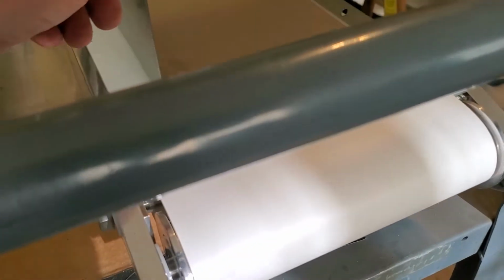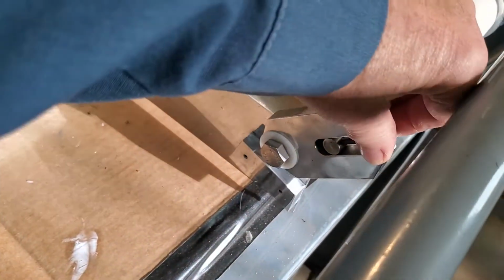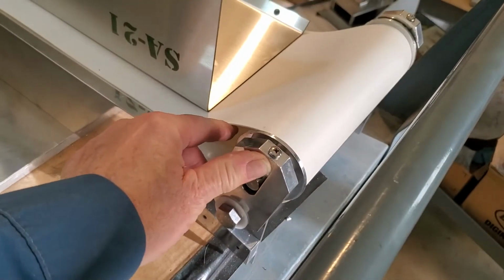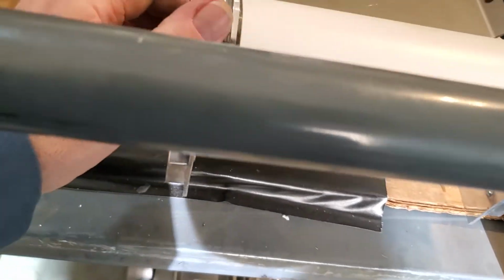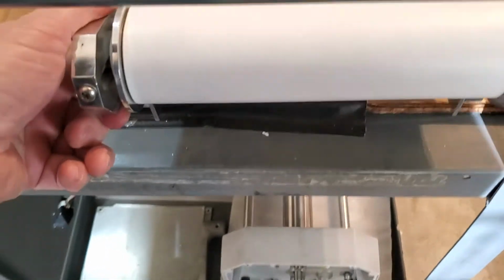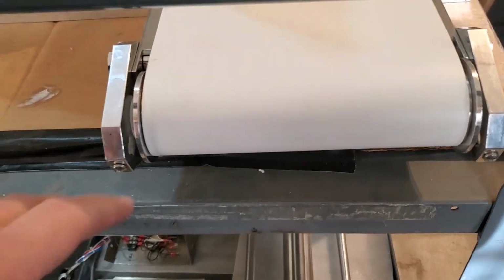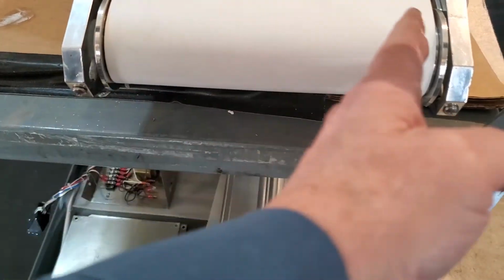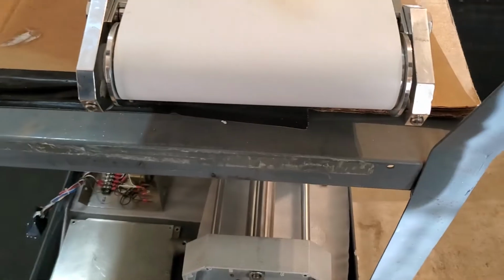And then they flip up. They hinge on that bolt, so you can take the conveyor belt off. So you can get the slack in there to remove the belt, and then it just drops back down into place. So there's adjustment on each side. Sorry, this is some of my worst camera work, isn't it? Just on each side, and you want to adjust it so as the belt travels, it stays even between these two sides, so it doesn't rub on the side.